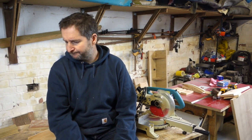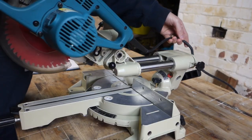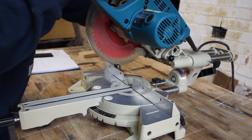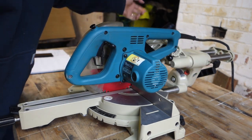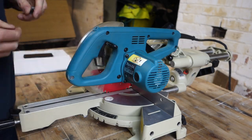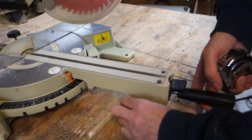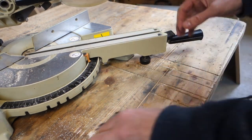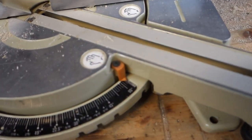To conclude: £350 — not too expensive for a Makita saw of this build quality. But there are a few limitations I find: the depth and the fact it's only a single bevel. If you're doing skirting, it's nice to always cut from the same side to maintain accuracy, and you can't do that with this. So if you're doing quite deep skirting, this may not be for you. But if you're doing smaller skirting, picture framing, or smaller items, this is a fantastic little saw.